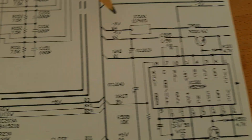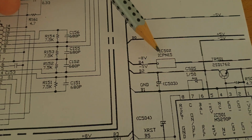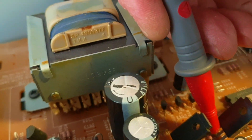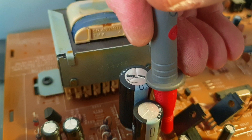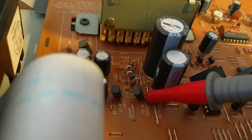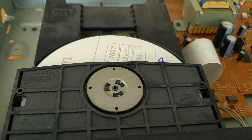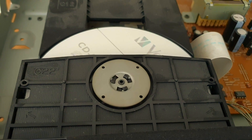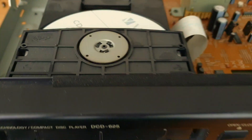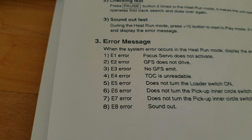As we see from the schematic diagrams, there are several voltages that should be present: plus and minus five, and plus and minus nine volts. We have plus five and minus five, and here is minus ten — which is close to minus nine. And plus nine is also a bit on the high side, but that's not a problem, I suppose.